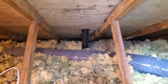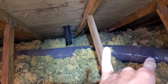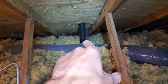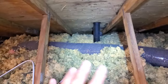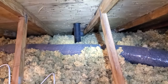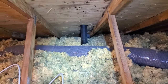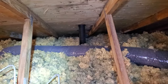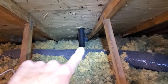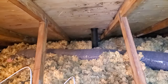This house has two bathrooms, and some people think you can tie the two bath fan vents together and take them out one discharge — you can't, or shouldn't. They do make booster fans where you can tie the two together; it's called a dual-purpose vent or something like that, and they're pretty pricey. Otherwise you just have to run the two separate ducts the ways I just showed you.